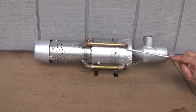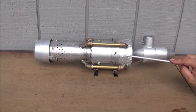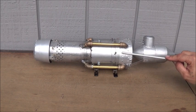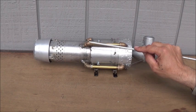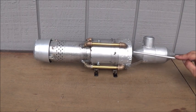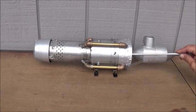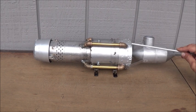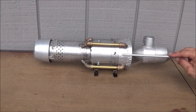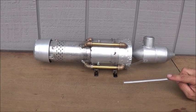We take air from the intake cowling here from our compressor. Any extra pressure that's generated that's not being used in the turbojet now bypasses through a series of reed valves through the top plate of our diffuser and then out through our bypass tubes and into the ramjet engine portion here. Right now I just want to see if the compressor itself generates enough extra pressure to overwhelm the reed valves in the top plate of that diffuser to be able to power up our ramjet engine.